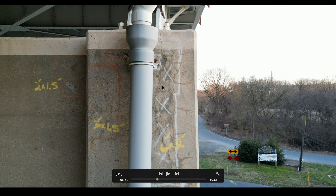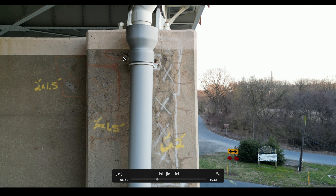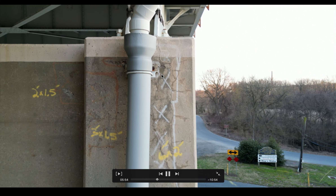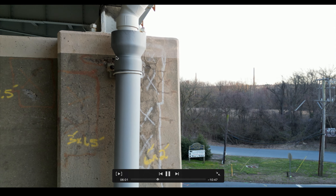This fracture is not coincidental — it's not water in it, or now it might be water, but this is based off of this load. And then we have this fracture crossed here, probably based off of these anchors they used — the anchors themselves swelling up and creating this new shear plane. It's like doing a wedge in a stone: you drill a hole, put a wedge in there, drive something between the wedge, and it separates and breaks apart the stone. These are the same thing with concrete — these are built-in internal wedges. The steel swells and expands and causes this failure, this fracture line. These are no exceptions — the anchor bolts.